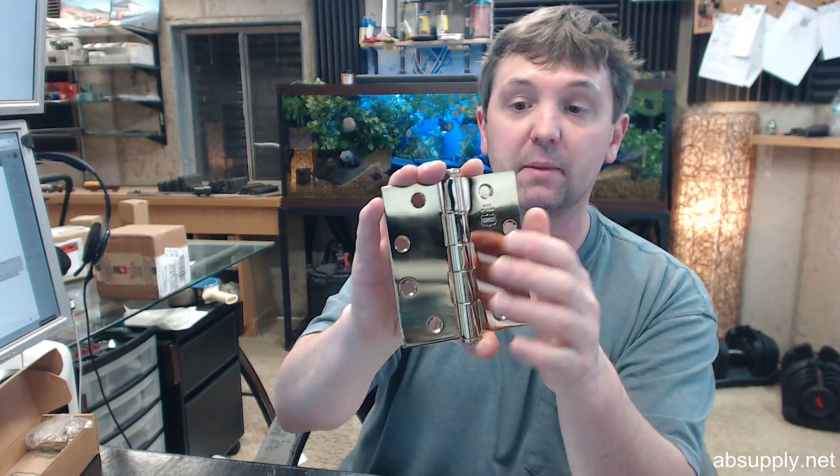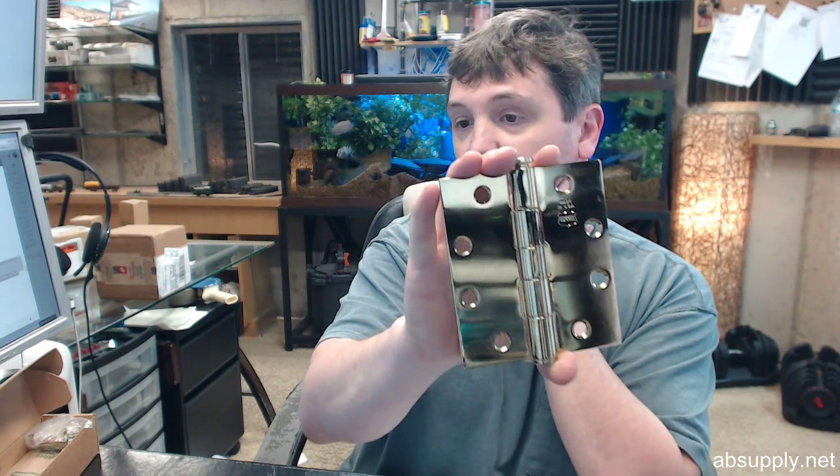The rows under those columns give you variations on this 5000 series, or 5-knuckle and 3-knuckle for that matter, hinge. If the 3rd digit in the part number becomes a 1, as in a 5010, then it's a wide throw hinge, meaning that the hinge is wider than it is tall. An 8000 hinge is the same hinge except that it's a 3-knuckle hinge. And when you add the BB in front of the 5000 or 5010, it's ball bearing. And a ball bearing hinge in the 3-knuckle becomes an LB. It's lube bearing. So it's the same sort of concept.